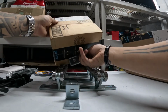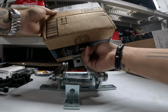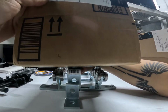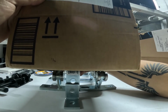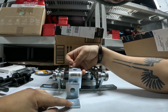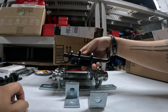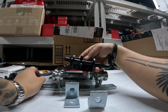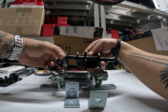All right. I'm going to mount it as far back as I need it to, so that I get the desired extension, and then the slide won't come out any further than that. So as the slide is making its way out, both pieces of the angled aluminum would hit each other, and that would act as a stopper. The reason I'm going this route, using these two pieces hitting each other as a stop, is because I was originally going to do some sort of latch method, but obviously I can't stick my arm 5 feet past the start of the slide to unlatch it once it does latch into the same point as the first latch would latch onto.